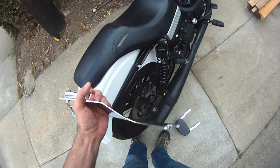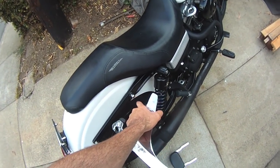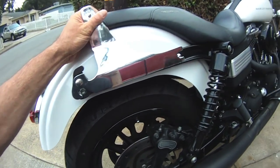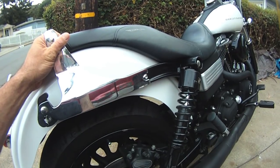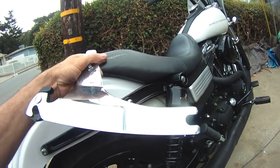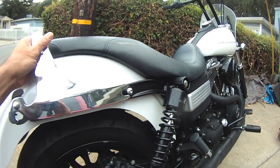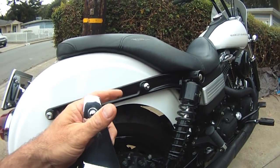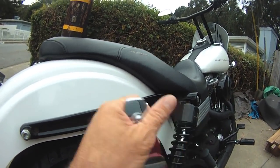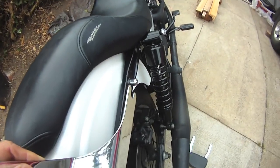We'll see. The nice thing about the 2001 FXDL is that it has the same bolt spacing as this 2007 Dyna. I measured bolt center to bolt center and they're the same, so that's good. Now, am I gonna buy the hardware? I don't know. Honestly, I don't even know what the hardware runs. $50, $75, $100. Isn't that what HD stands for? If you want anything, bust out another $100. I don't even know what the mounting kit runs for these detachable ones, because I didn't look. It comes with wider spacers and longer bolts. The spacers have a notch cut in them. Well, I've got a lathe and I can make my own notches.